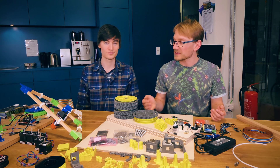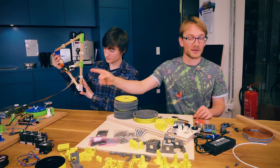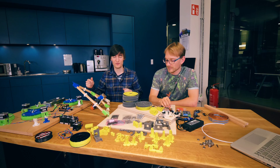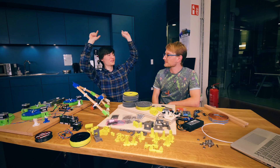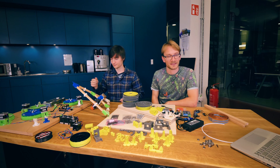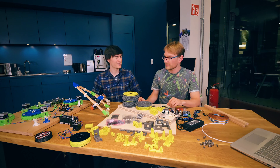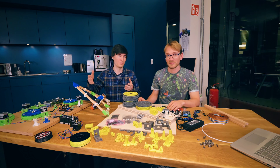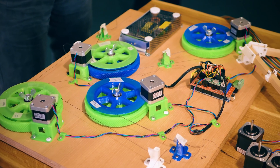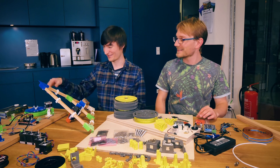The last real part of this entire construction is the ceiling unit, and that's also where most of the stuff of this printer lives. Let's start with the base plate — you want a fairly light plate because you will need to lift it above your head when you mount it, but once it's mounted, you want it to be as stiff as possible. This is upside down right now — it will be the other way around on the ceiling. Roughly 47 centimeters by 47 centimeters — 19 by 19 inches. You'll have an easier time if you go slightly bigger. There's a lot of stuff mounted to this plate, and it might look very well planned out, but it was thrown together quite quickly.